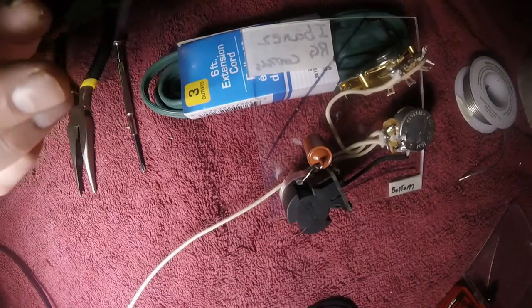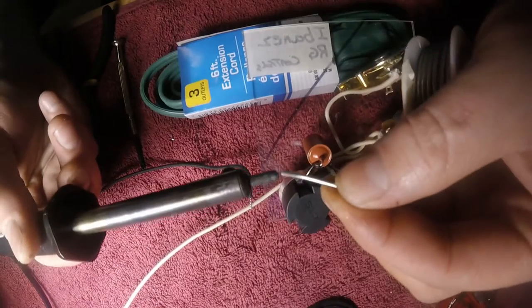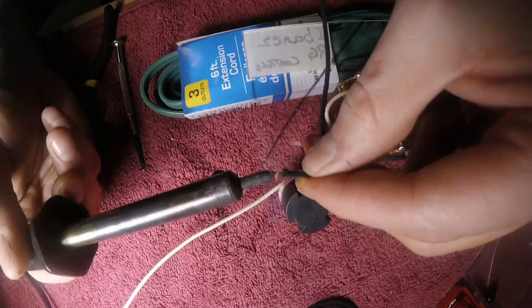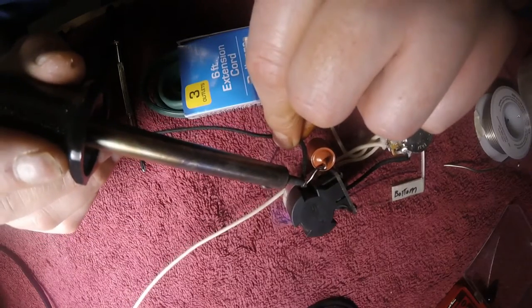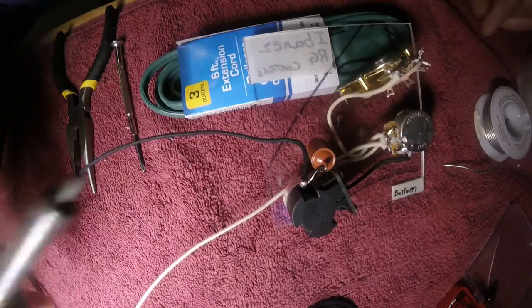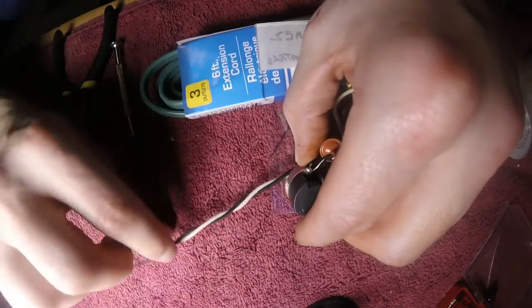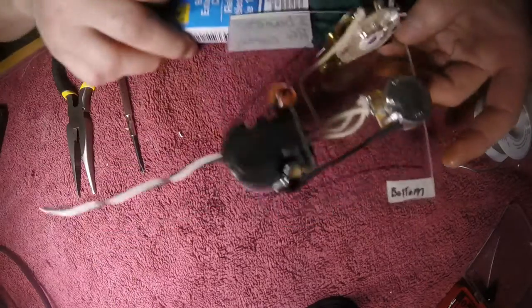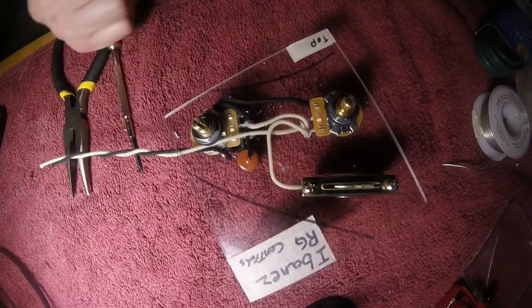With my output ground, same thing as I did earlier — I'm going to load that wire up with just a little bit of solder on the end of my soldering iron, then drop it right onto the end of my wire. Come in to where we already have a little bit of solder, give it some heat, melt it in — done. Minus the output jack, which I will reuse on the RG-550, this is one complete five-way with a push-pull for an RG-550/570. I'll be soldering up the pickups themselves in the next video while attaching it to the pickguard. Thanks for watching.